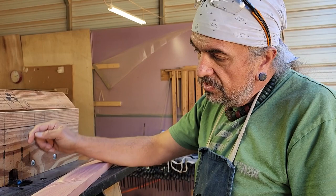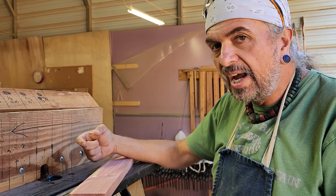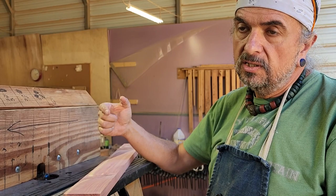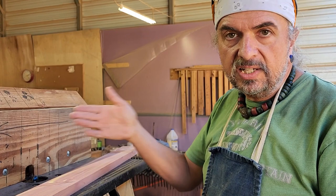The size of this core box or flute bit is 3/4 inch wide. That's the diameter that it'll cut. They say it's a 3/8 inch radius. I don't know why they advertise it based on the radius versus that, except for the fact that people maybe in the molding business, which is usually who buys these, only need the radius, they don't need the full width, but you'd think they would put a bearing on the top of it if they're making molding out of it, so I don't know.